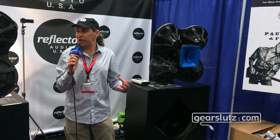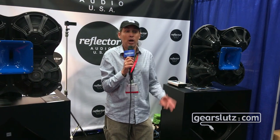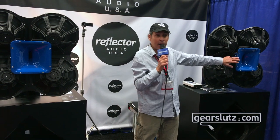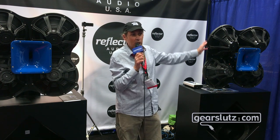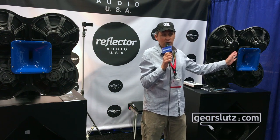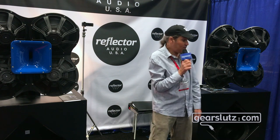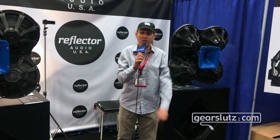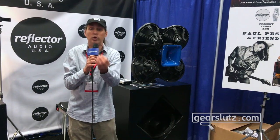These are just some of the features and techniques we use to create our groundbreaking, paradigm-shifting audio monitor system. We also have several structural patents on our bracket and cabinet. The components are third party: we have an 18 Sound horn, Faital 15-inch short-range drivers, and Faital 18-inch long-range drivers. The Q18 system we recommend uses Faital short-range 18s and Faital long-range 18s with the same 18 Sound driver. For amplification, we have a thousand watts on each of the 18s via the Hypex amp, a thousand watts on the group of 15s, and 250 watts on the horn — though we only drive it at 35 watts, resulting in a soft and buttery horn, not a sharp, aggressive, angry horn.